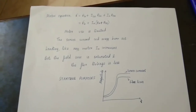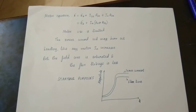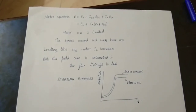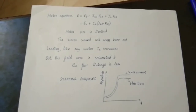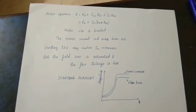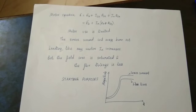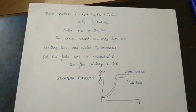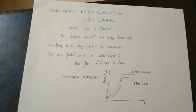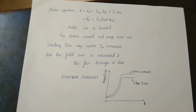The series motor uses a series connection, so a high amount of current flows — Ia is equal to the flux. At starting, the motor has high starting torque, so you can start it under load. But if you look at no-load, the motor reaches high speed. The high flux and current are not balanced without a load, so the motor may be damaged. Hence, the current leads to saturation and the coils may burn.